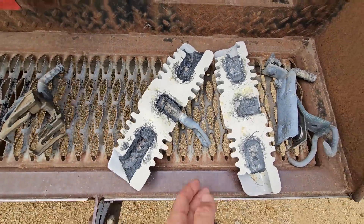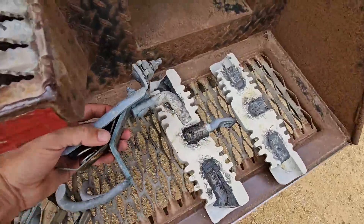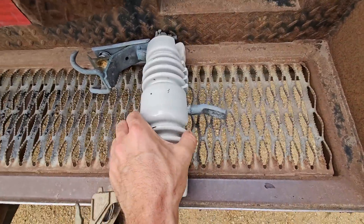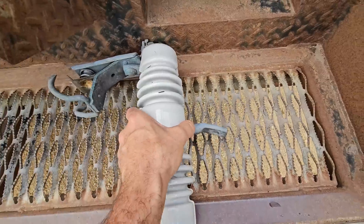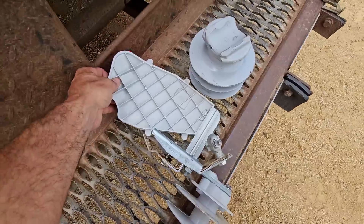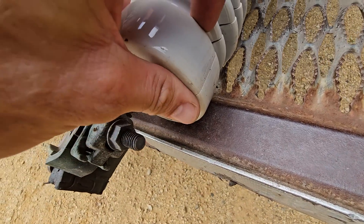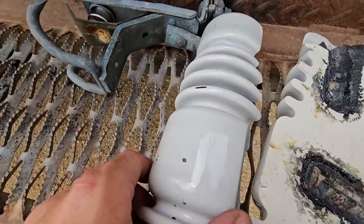So this is a porcelain cutout — you can see it's very similar to this other one here. You have a bracket where the door goes, so the door would have gone right inside there, and then the bottom portion of the door would have been inside here. Before breaking it would have looked something like that, very similar to the one here which has the load break feature we won't cover today. Obviously that crack is really obvious now, but it would have been such a hairline crack that it would have been very difficult to detect with the naked eye.